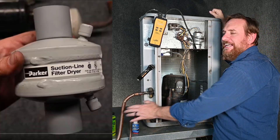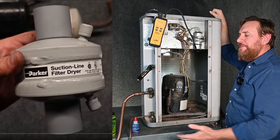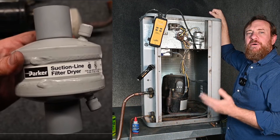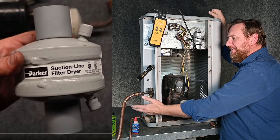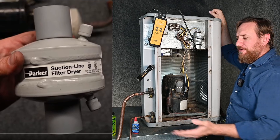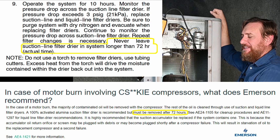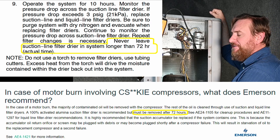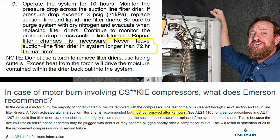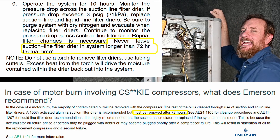Another thing to think about is a suction line filter dryer. The suction line is running below dew point most of the time — in other words, there's condensation building up on the suction line. That's a metal filter dryer always in a wet condition, so that suction line filter dryer is notorious for leaking. We want to make sure we check the suction line filter dryer and also check for pressure drop across it. If it's a 410A system, we want to make sure it hasn't stayed there for more than 72 hours — most manufacturers recommend against that. So if we see that suction line filter dryer still there, that's another red flag, and when I find the leak I want to make sure I take it out of the circuit.